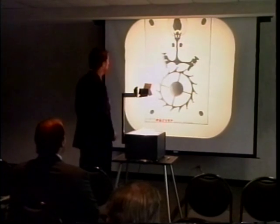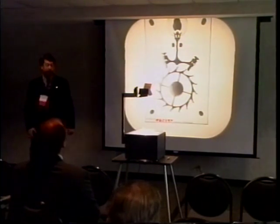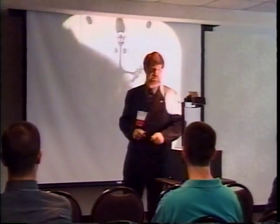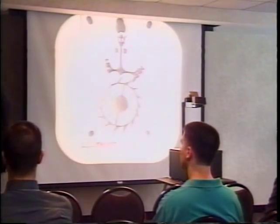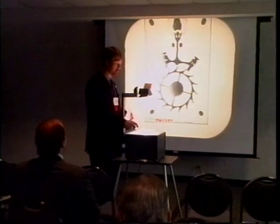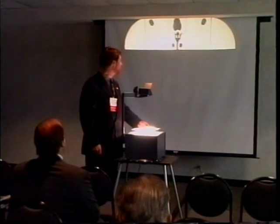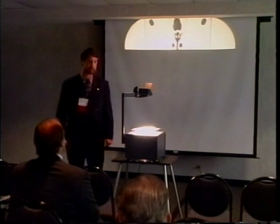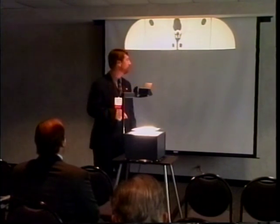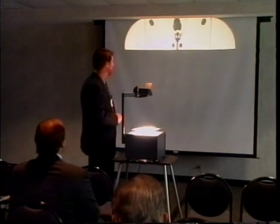So the next thing we want to do is we want to adjust the escapement. And lots of times, most of the times, the first thing people will do, they'll look at the pallet stones. Oh, let's adjust the escapement. You know, the first thing we got to do is get in there and start cranking on the pallet stones. Well, we really don't want to do that. Well, this little line here in the screen even helps to divide that. First thing you want to do is start on the opposite end. We want to make sure that when we're all done that everything comes from the line of centers, and that everything is in sync with the roller jewel end as well as the pallet fork end.